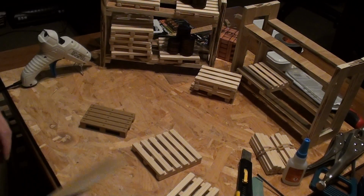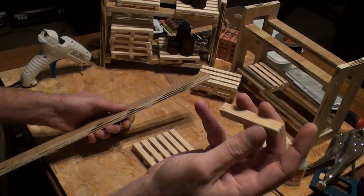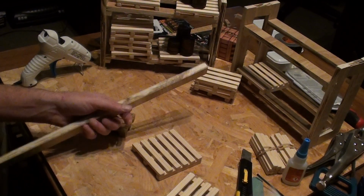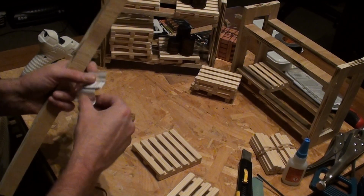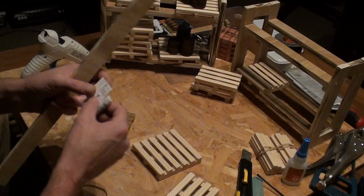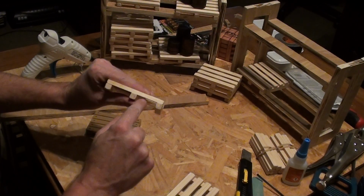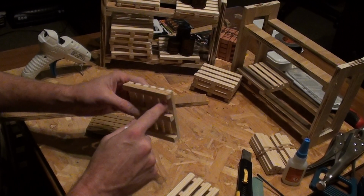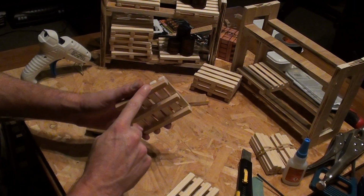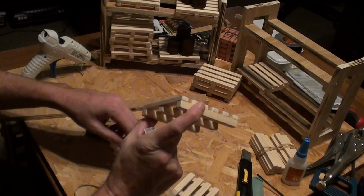So what I used was basically centimeter square lengths, which were 2.4 or 2.2 meters, I can't remember quite exactly actually. There's my label. 2.4 meter lengths, and yeah, 2 sizes. For the top parts is 6mm by 11mm, and the square pieces aren't quite square, I think they were 10.5mm by 11mm, and again that was a 2 meter length, and this is just pine strip wood.